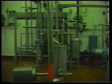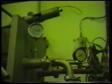This is the pasteuriser or plate heat exchanger. It heats raw milk to about 72 degrees centigrade, then rapidly cools it to about 3 degrees centigrade. The hot and cold temperatures are recorded. The milk has to be held hot for 15 seconds in the holding tubes shown to the left. The pasteurisation process kills all harmful bacteria without destroying the food value of milk.